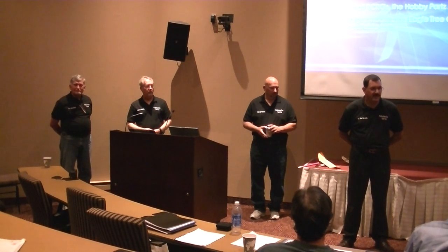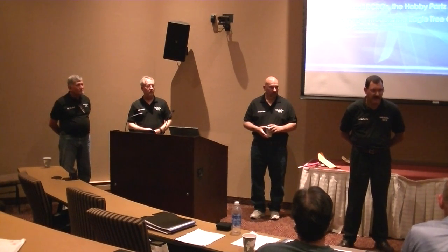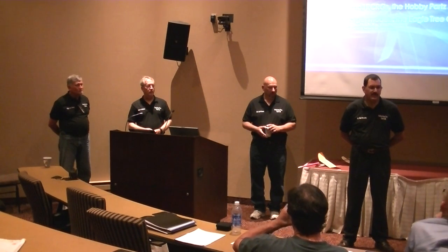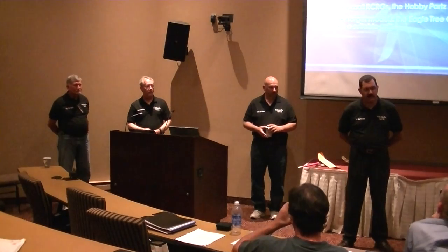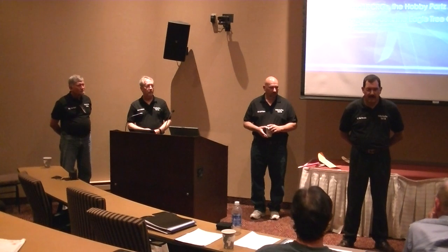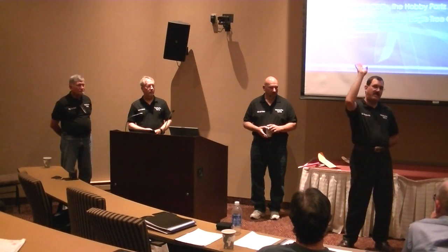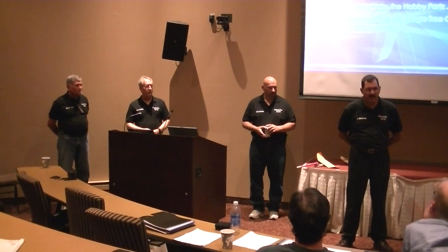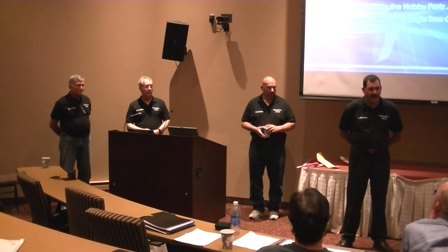I originally started this off to fly on my electric high-performance gliders, and they are getting high boost or launch speeds, just like these SA gliders are. Probably about half the speed of an SA glider, but still quite high. And they're having the exact same problems. They're pitching over and coming back on you. When I added this, it did help stabilize it, but it wasn't quite fast enough. So that's why we looked for another alternative.